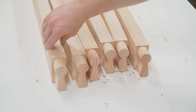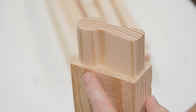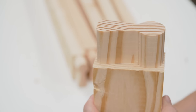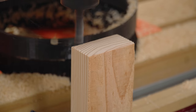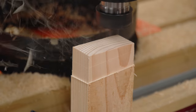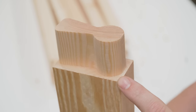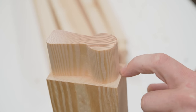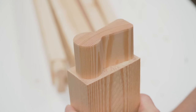All these cuts turned out great, with a couple of things to learn and tweak along the way — like whether to use a scoring cut. All of these were cut with an upcut bit, and there's just a tiny bit of fuzz — very nitpicky. When you cut in the vertical orientation with an upcut bit, your cuts are pretty much always flawless. The scoring cut makes them even more flawless, though it doesn't make a huge difference. One thing to note: there's a flat at the top of the keyhole that's not supposed to be there — the scoring cut was a full one-eighth of an inch deep, which was too deep, causing it to interfere. I had to back it off quite a bit, but that's just a setup error.